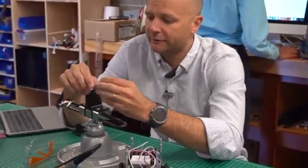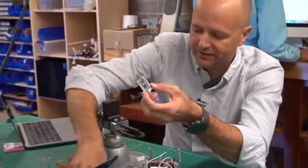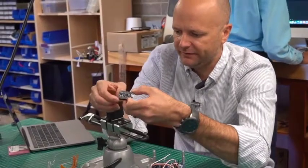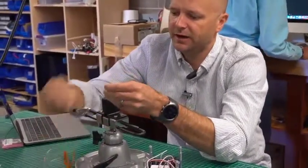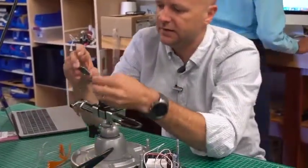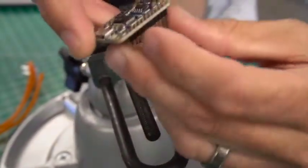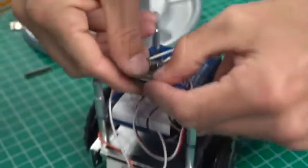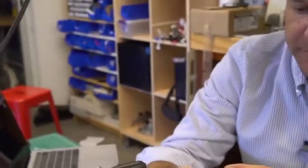This one requires soldering in order to get it to work. It comes with these pins, but they don't fit in here — there are too many pins. You are going to have to count off how many you want and break them off. Now you will see these fit right in here and they also match up to a breadboard, so you will be able to sit this right on top of your breadboard and wire it up. But you need to solder these pins onto the board in order for this to work.